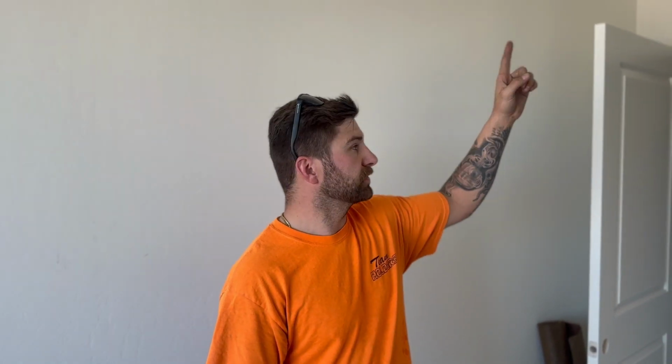And man, those bedroom returns are pretty large as well, so you guys are going to be moving some air throughout the house, right? Yeah, so the main return is a 20-inch. Each return in all the bedrooms is 14-inch.